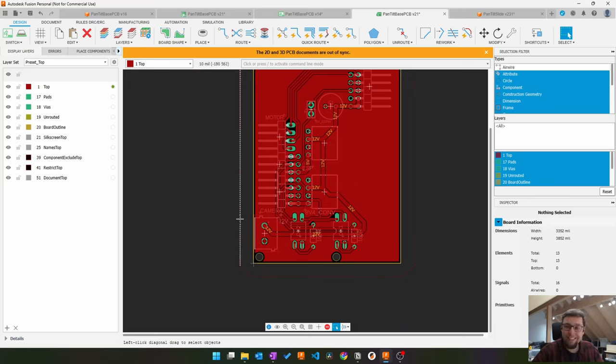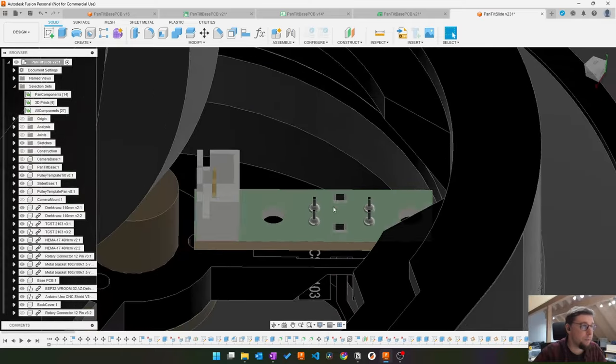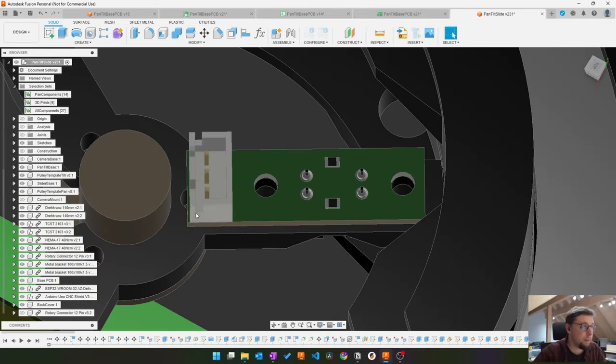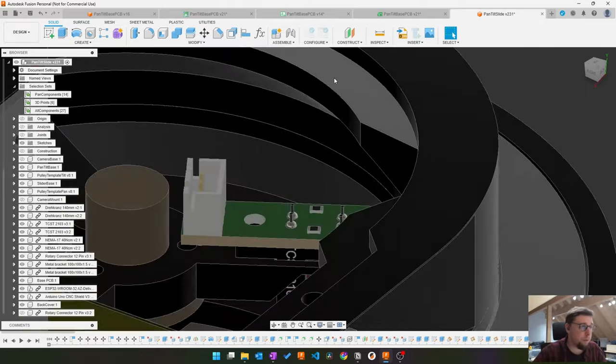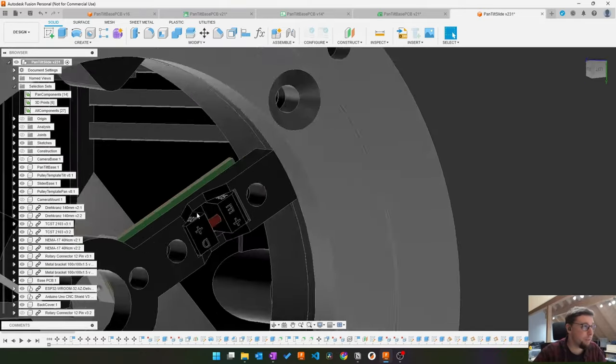Oh yeah, almost forgot. What I did forget here is the end stop signals. I have optical end stops, these here. So they need 3 pins: ground, then a supply voltage, and a signal comes out. And the signal is, I've showed you the optocoupler earlier, and this is pretty similar.